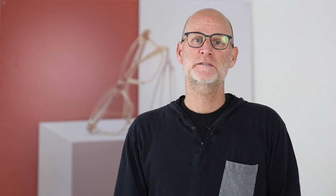Once the acetate sheets are finished they are cut into slabs. These slabs are then loaded into five-axis CNC milling machines. Through a series of milling processes the acetate slabs are milled into the front shape of the frame, first starting with the inside eye shape and then continuing with the outside edge and the nose shape. Various milling bits are used to add radius to the outside edge or different design details.